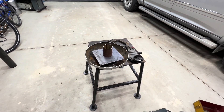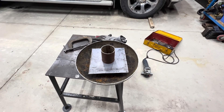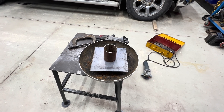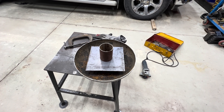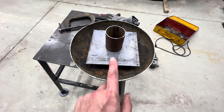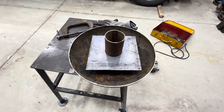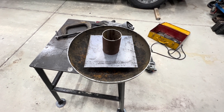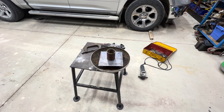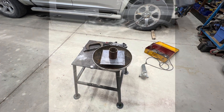That's about all I have time for in this video. Things are actually moving along really well and I'm quite pleased with how everything's coming together. It's going to probably take another night to get the burner completed. I also need to cut the door into the side of that combustion tank and make it hinged. It's going to be important to have a good seal around that door because we want all combustion air to come through this tube — anything coming through that door will cause turbulence and inefficiencies in the burn. Thanks for checking out this video. I hope to have more coming in the next couple days or so. If you like what you're seeing, don't forget to subscribe.